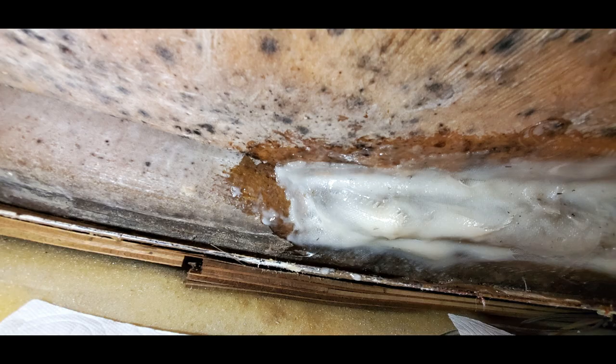And it looks like the fiberglass cloth kind of lifted away in a few spots. But all in all, the thickened epoxy stayed where it was supposed to, and most parts of the thickened epoxy are covered with fiberglass. And I think this is going to be just fine. We're going to also do the repair on the outside as well, so moisture's not getting in there. It'll be good. Luckily, nobody's going to see this repair.